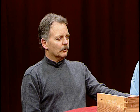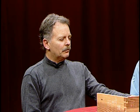I think it's kind of a marketing thing that happened over the years: everything's being made cheaper and cheaper these days, and they're starting to use plywood instead of solid wood. And that's not necessarily a bad thing, really. Well, plywood got a bad rap because in the beginning, plywood was really good, and then it got really cheap. You can get really bad plywood made of thick, lousy cores that warps. Cheap plywood is as bad as cheap anything. And if you buy high quality veneer core stable plywood, then you're good to go.